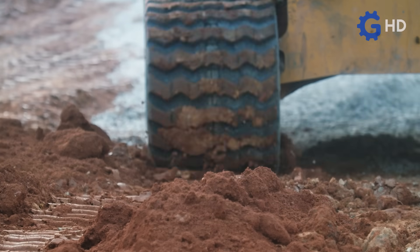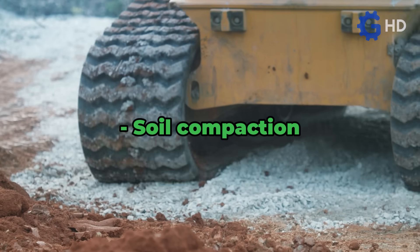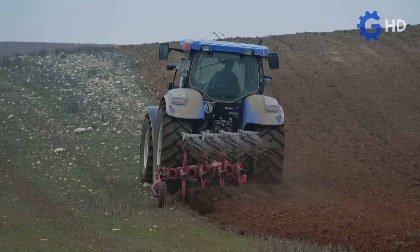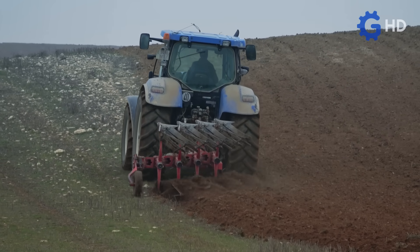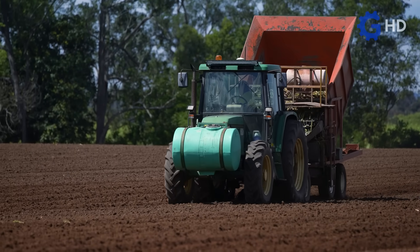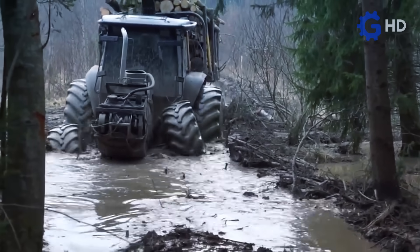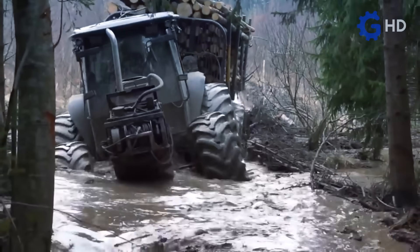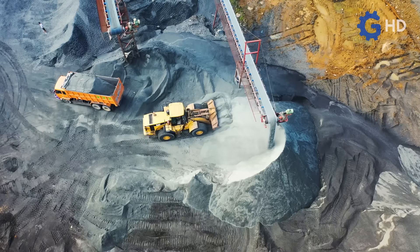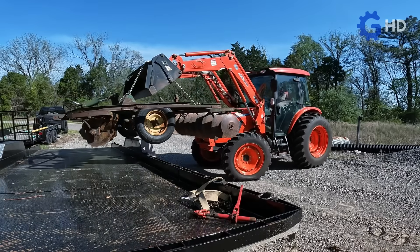While we can discuss an overall improvement in tractor performance, the benefits of using ballast fluids are also associated with reducing soil compaction. Although it may seem contradictory due to the added weight, water-filled tires help evenly distribute the overall weight across the tire footprint, reducing surface damage to the crops, which helps maintain soil fertility and composition. Just as in agriculture and the forestry industry, water-filled tires make it easier for hauling tractors to transport large, heavy loads over muddy terrain. In the industrial sector, lifting equipment can remain stable during loading and unloading operations, a feature that also applies to agricultural tractors equipped with front loaders.